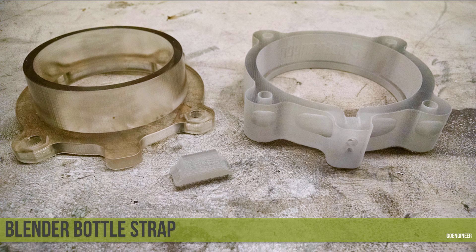One interesting thing is the difference in color — both parts are the same material, printed at the same time, yet they're two very different colors. That's because the support material on the right-hand part, creating the matte finish, created a barrier that prevented excessive UV exposure. I can achieve that same look on the gloss part by post-bleaching — basically sticking the part under fluorescent light for a few hours to achieve the same level of clarity.